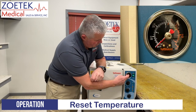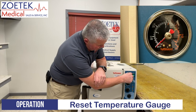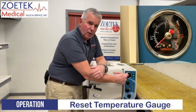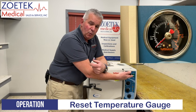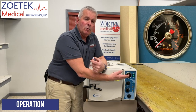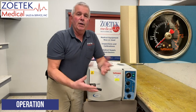Our gauge here will start to increase. There's a little knob in the center of this gauge — if you turn it counterclockwise until the red pointer is right on top of the white pointer, what happens is as the white pointer goes up with temperature it pushes the red pointer with it. When you're done and the temperature drops, the white pointer drops back down but the red pointer stays at your maximum temperature. You always need to reset this down to zero if you want to use that function.